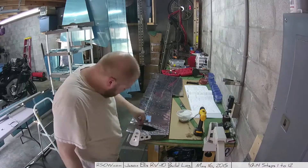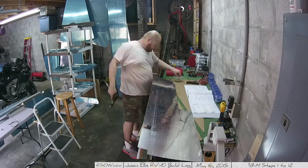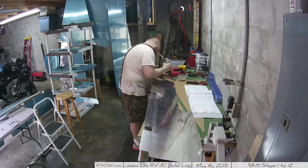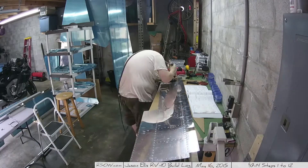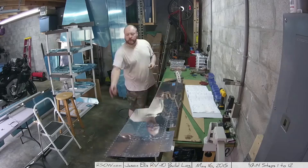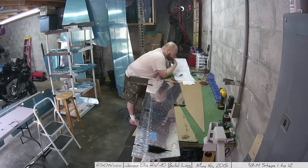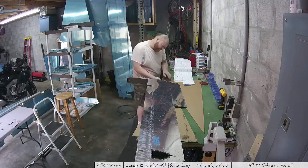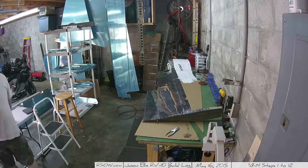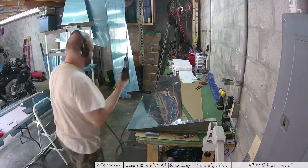It was a little awkward more than anything. I could see why leaving that skin unriveted would definitely have been handy, but it was not an insurmountable problem. I've been speaking to some other builders about mistakes and what you can do, and the majority said 'don't sweat it, mistakes are going to happen and weirdly this plane will still fly - just do your best to mitigate or fix them.' Here you see me putting the tip rib on and doing both sides, then riveting the little gusset on the inside.